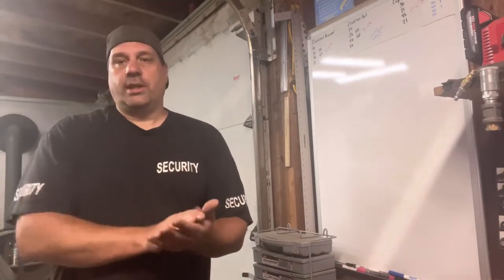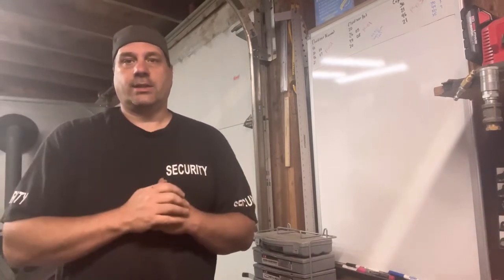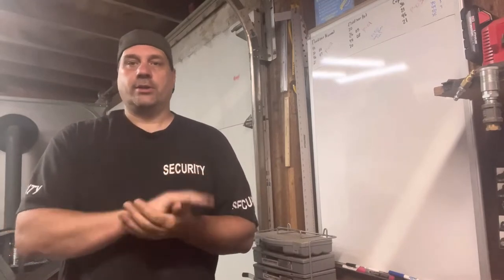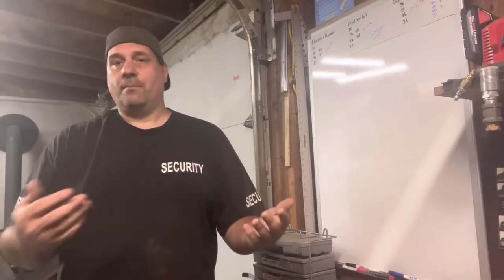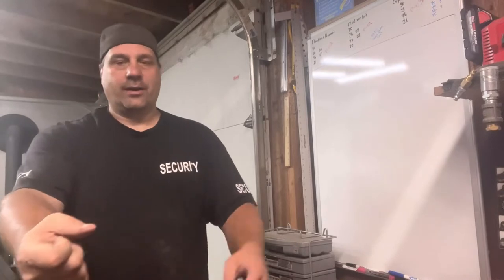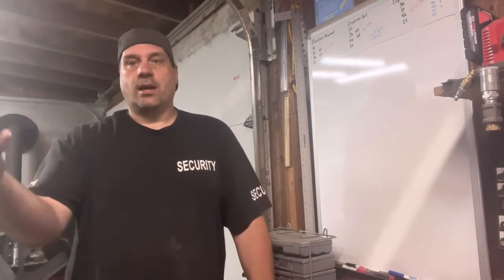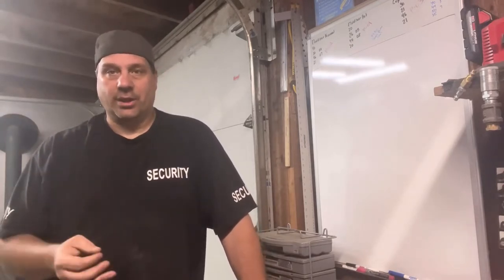So our machines, we have two machines. We have the KKHD that they say you can adjust the microamps and you can adjust the KV. The only issue is you kind of have to do it before you even put powder in it. You have to hold it up in the air, pull the trigger, adjust one. Then you have to put it against ground, pull the trigger, adjust the other. And then when you start working, you don't have numbers. So if you're adjusting a little bit, even though the machine's showing you numbers, it's not truly adjustable.